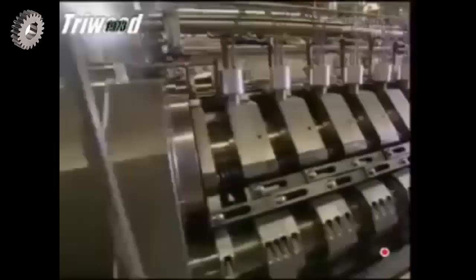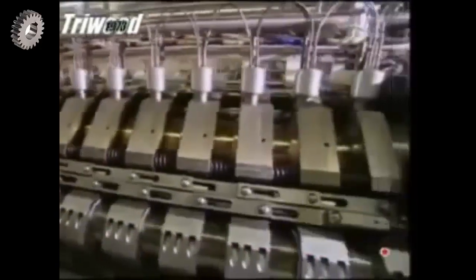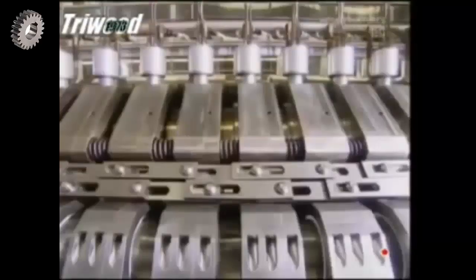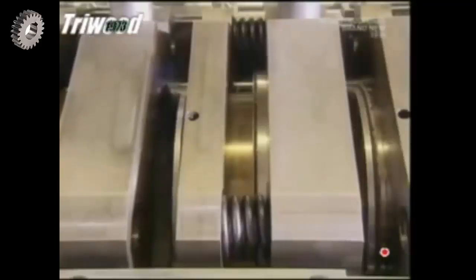The beans are almost 50% cocoa butter, and roasting reduces them to a liquid paste. However, this butter solidifies at room temperature and you'd never be able to spread it on your toast, so it needs to be removed. To do this, the paste is sent to these enormous presses which squeeze every last drop of butter out. The liquid butter is sent on to be used in other products, but what emerges from the machine is a chocolate lover's idea of heaven.